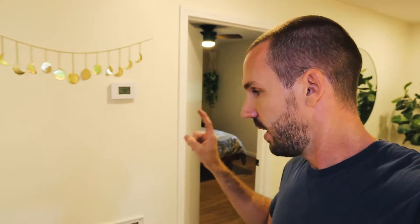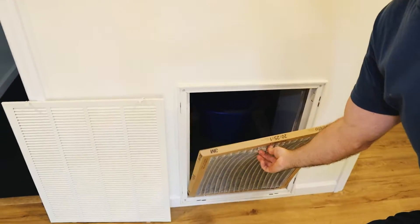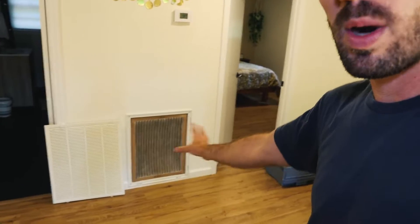I'm going to test it while I do other things around the house to make sure there's no more leakage. One other thing to note: this will most likely solve that issue, but the other problem could be the return vent. There's so much suction going through there and not a lot of return air getting to my unit. I'm going to add another return vent downstairs — not in this video — to give it about 200 more square inches. This is about 400 square inches here (it's 20 by 20). I need about 200 more because it's a three-ton unit and you need 200 square inches per ton. If you don't get enough airflow, your AC unit could freeze over, and when that frost melts it could cause water to leak through. So that could be another reason this is leaking — most likely it's the P-trap, but we'll check.